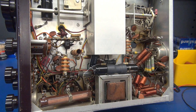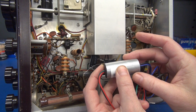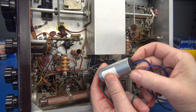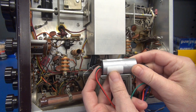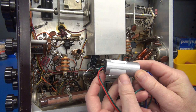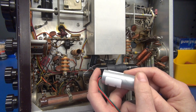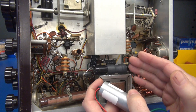There are some capacitor kits available that I've seen on the web for the Rangers. They come in this type of packaging and usually have a little white nylon clamp - they want you to put a hole in the shield and clamp them in place. I'm concerned about the quality of these new cap assemblies. They're kind of a homebrew cardboard tube with plastic caps stuffed with components, and the high voltage cap is actually this size, if not a little smaller. What concerns me is the size of these filter caps to handle 500 volts - all of a sudden I've got a little guy crammed with two little caps supposedly handling 1000 volts. In my opinion, I wouldn't use them. I work on a lot of old vintage amplifiers - the Fenders - and I put in top quality caps. I consider the Ranger kind of like a Fender amplifier; I'm going to put in the best components I can find.